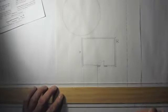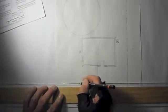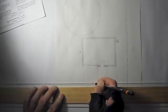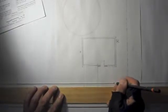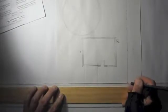Now an easement line, just like utility lines, any of those, is just a bunch of dashes, right? So a dashed line. We want to remember that in our design work, is that there's an easement there, and that is special consideration. We're not going to put a really expensive plant in there that might get ripped out when they redo the fiber optics or they redo the road. They add some more pipelines. You never know what's going to happen in an easement, and there's lots of different kinds for that.